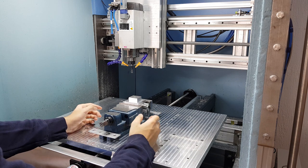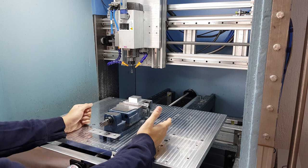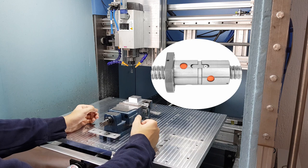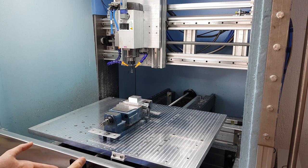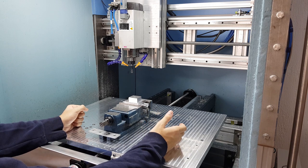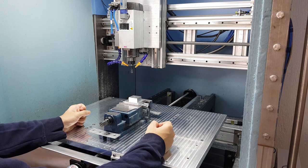The following error on my Y-axis is around 10 micrometers, which is really good. But on my X-axis, it's around 30 micrometers due to backlash. If you get a ball screw with two nuts to compensate for backlash, it will give better PID response. In theory, combining a rotary encoder and a linear encoder should give better results, but when I connected both and set P-only for the rotary and I for the linear, it did some really weird things.